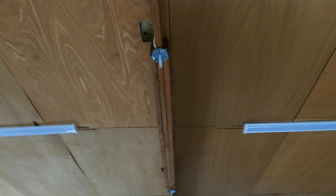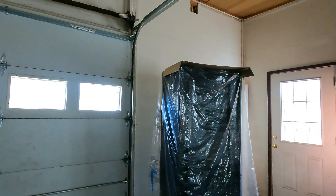They added more outlets over here, and added a light on the west side of the garage to shine in the dark spot. They also put outlets on both sides of the garage doors, which is great for working outside — I can plug in right there instead of running an extension cord all the way over. They also added an outlet up high because I'm adding a side-mount garage door opener, and I'm going to have somebody raise the garage rail so I can raise the door. They also added all the wiring in the beam for the center lights. As I'm talking, we're getting a sheetrock delivery from Home Depot.